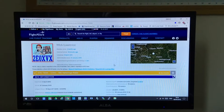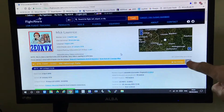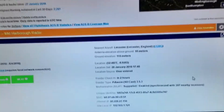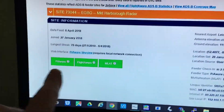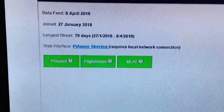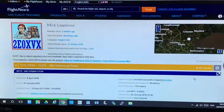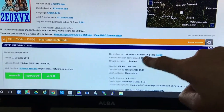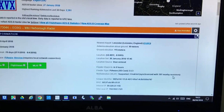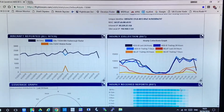We've moved over to the setup page and statistics. If you click the little cog wheel, you can set your height, longitude, and latitude. Once done, you get three green bars showing that your PiAware, FlightAware, and MLAT system are running and you're logged on to the ADS-B network. It asks where your local airport is — my nearest airport is Leicester, EGBG, and I have the antenna 10 meters above ground level on top of my roof.